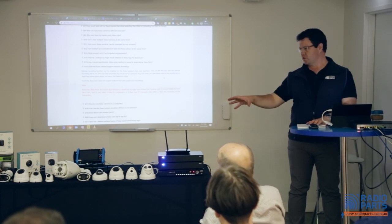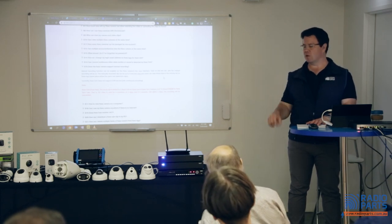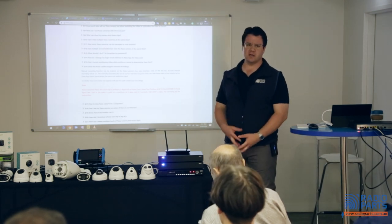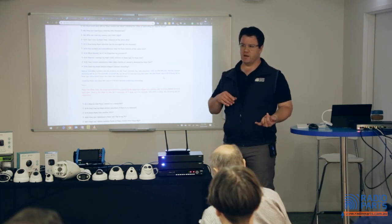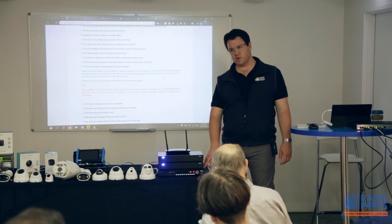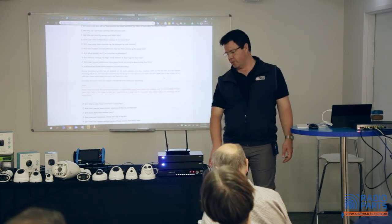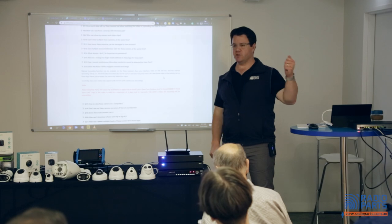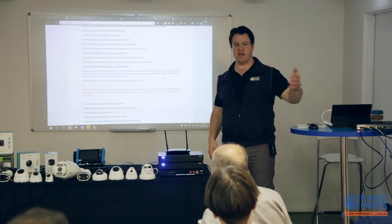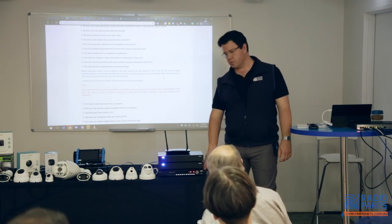On the other side of things, in the DOS security camera range, we cover everything from analog cameras to AHD cameras — which are a digital version of analog called Analog HD, up to 1080p and 5 megapixel. There's also TVI, CVI, SDI, and other versions of using coax to send digital information. Our hybrid recorders cover all of those, so you can plug in any coax-based camera and it will work. The key thing to keep in mind is you can't mix and match — you can't have old analog cameras, AHD cameras, and CVI cameras all together, because the DVR can't distinguish between different coax formats.